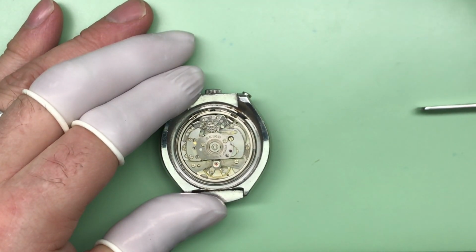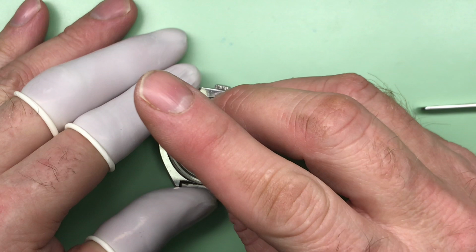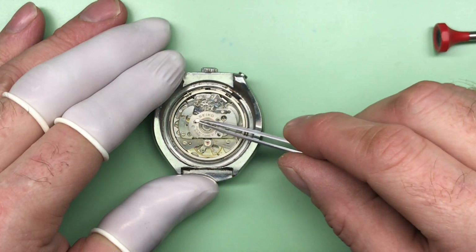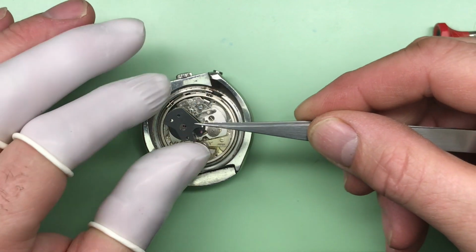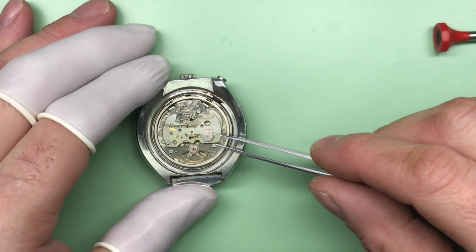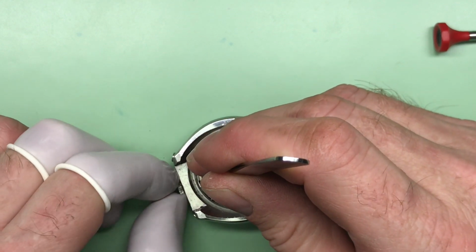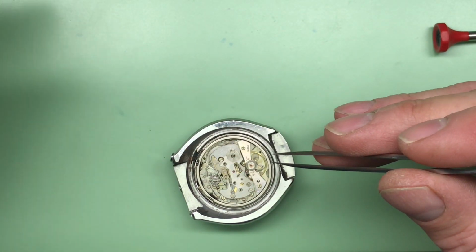All right, let's go ahead and get your bearings here. A little loose on these screws. Not terribly bad. Nice thing about a movement that hasn't been fooled with is that the important parts have been left alone, like the hairspring, other pieces, some grease there. Ooh, it's old, old grease. All right, go ahead and take your stem out. Oh, seals are rock solid.